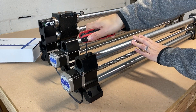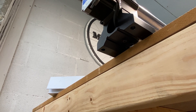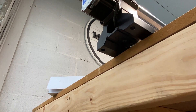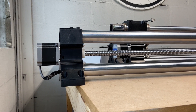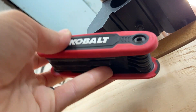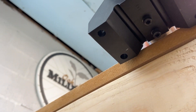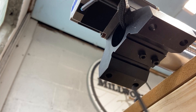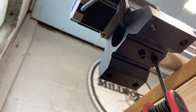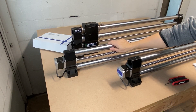The next part is you simply tighten the bolts on top, and then here's where it really matters. You have to shift it to the edge of your work table, but don't shift it the entire way off the table. You have to leave the foot partially on the table because that is what is maintaining those rails in their squared position. So first, just tighten the outermost bolt on the bottom. Once you do that, you're in the clear and you can pull it the whole way off the table and tighten the second one. Once you put it back up onto your flat work surface, you'll see there's no more rock and you're good to go.